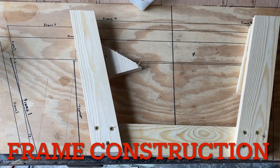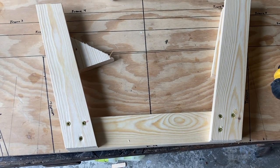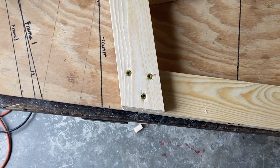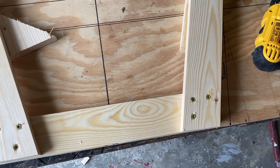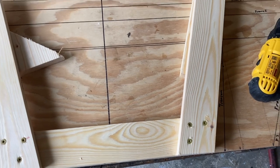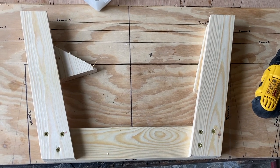When you lay out the frames, take your time. Make sure you get all the angles right. You can use the black sharpie lines to make sure that you have good angles. You can use the bottom of the plywood template — something to help keep you straight. When you set the screws, leave some room for the chine log in the corner and you won't have to go back and take out screws. I like putting the screws in before I start using epoxy so that things don't slip and move around. This way you can back the screws out, leave just the ends sticking out, get everything aligned properly, and then the screws act like a clamp. When you're all said and done, you have a very accurate frame.